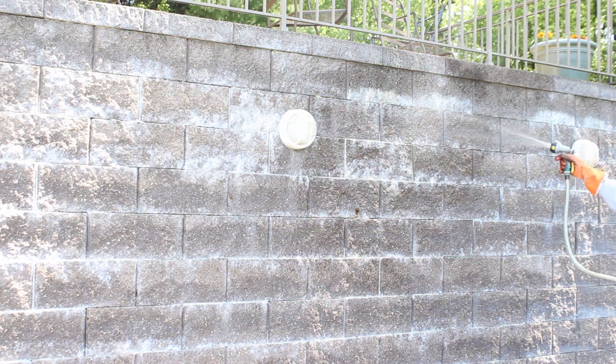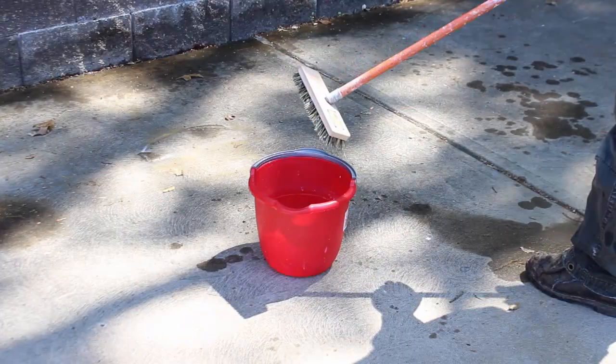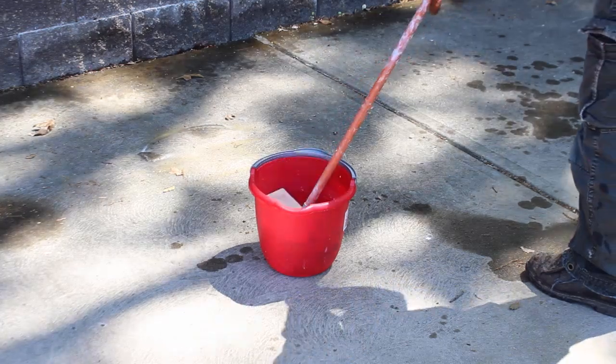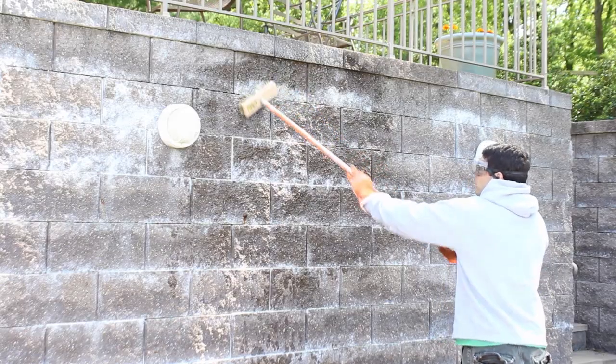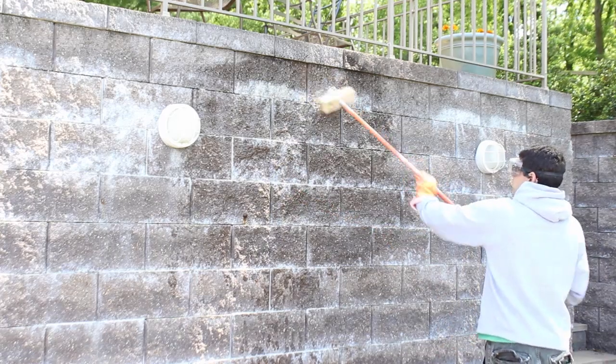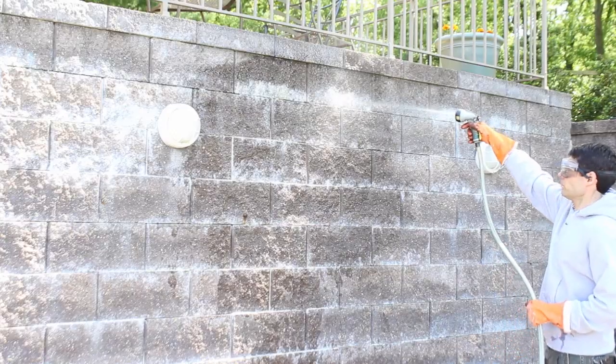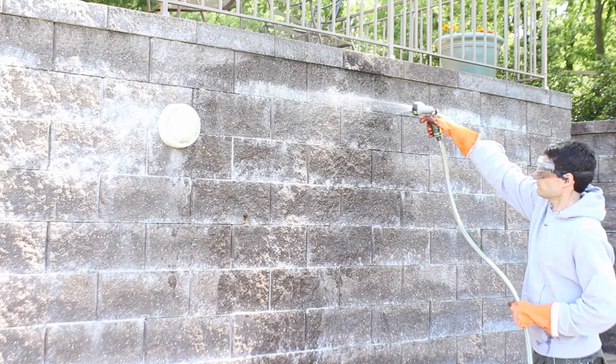As you can see here, my wall is just covered in efflorescence — it looks terrible. I'm going to pre-soak it with water like I did in the test run. The test concluded that the muriatic acid wasn't going to harm my wall. Then I'm going to use a plastic scrub brush and apply the acid to all the sections that have really bad efflorescence. You shouldn't have to scrub too much — just apply the acid and let it fizz. When it fizzes on the efflorescence, that's when you know the solution is strong enough.